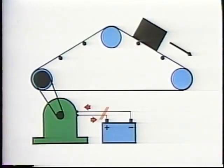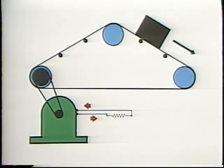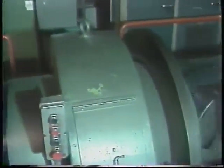If we disconnect the source voltage from the armature, the braking effect is intensified. The counter-EMF is no longer being opposed, so the reverse current in the armature increases and the braking torque becomes much stronger. In order for this to work, current must have a complete circuit through the armature coils. So when the brake switch is thrown, the motor controller connects resistors across the armature terminals at the same time as it switches the source voltage off. Since the counter-EMF decreases as armature speed drops, current and braking torque will decrease as the motor slows down. At zero speed there will be no braking, so mechanical brakes are often engaged when the motor reaches a slow speed to complete the braking.